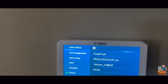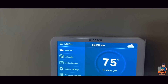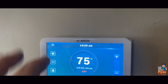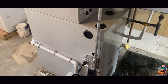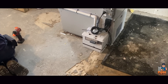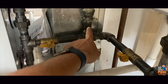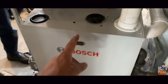We are registered with the thermostat. Let's review — the fossil fuel complete system is off and it's updating from the cloud. We go to menu, then mode, select heat, and confirm. We raise up the temperature. The condensate pump with built-in neutralizer is discharging into the standpipe. Gas is on — one-inch line coming down with a three-quarter reducing coupling and a tee to the water heater and a tee to the Bosch — and Houston, we have ignition! Beautiful.